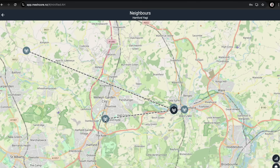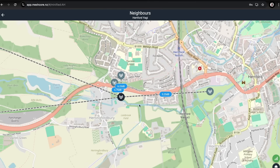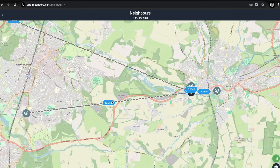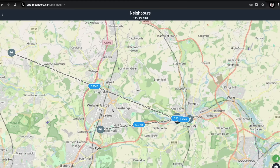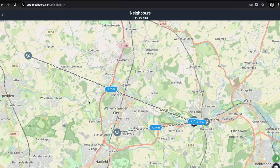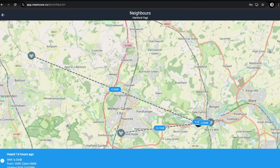This station is WGC Omni - we're linking to him over there in Welwyn, shout out to you! If we click the signal strengths button, you can see signal-to-noise ratios. On the really close ones it's in positive figures - plus 6, plus 5, plus 5.75 - really good signals. This longer distance one isn't as great, which isn't unusual. Most signals will show a negative SNR value because it operates down in such low noise.